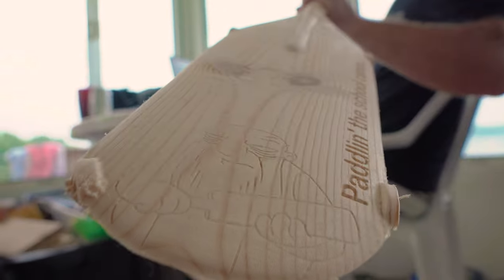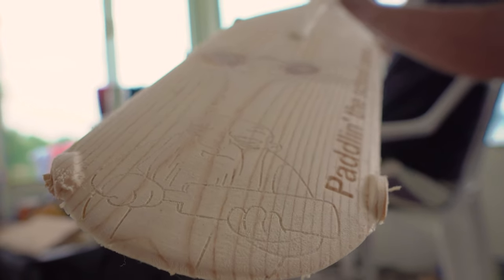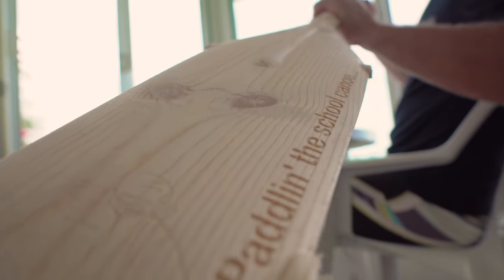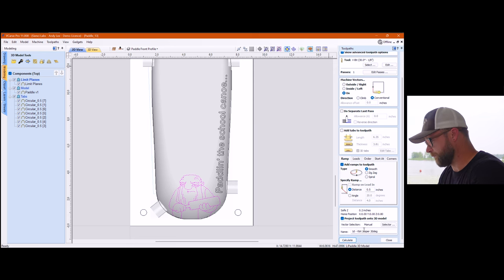Louis, B-roll me. Obviously Jasper has not been compressed aired out, but my carving looks pretty spiffy. I know it's not an actual V-carve toolpath, but it turned out pretty good. Bit of a cheat, bit of a workaround. 1/16 of an inch deep, 30 degree V-bit, on, ramped, named.